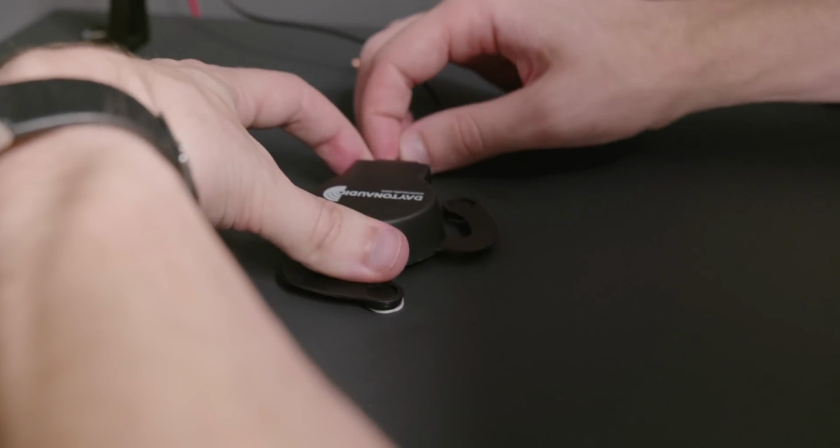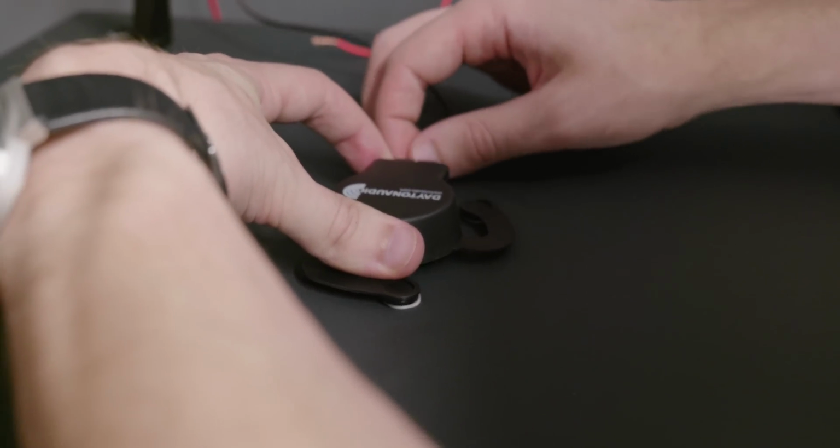The bass on these I solved just by crossing them over and using a subwoofer, same as I would do with my triangle speakers that are set up in there normally. And the treble, well, we just had to DSP in a lot of treble over 10 kilohertz. And it worked. It's not as detailed as my Vandersteens or my triangles, but it sounds massive.